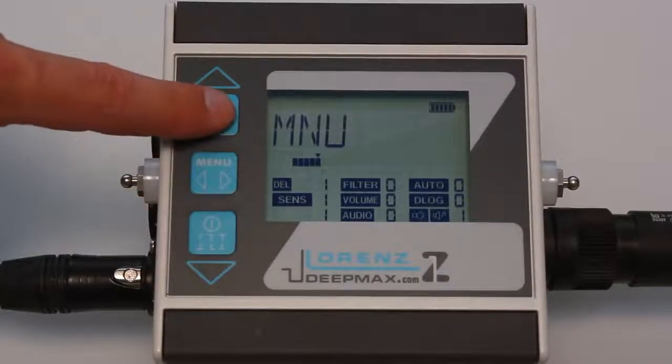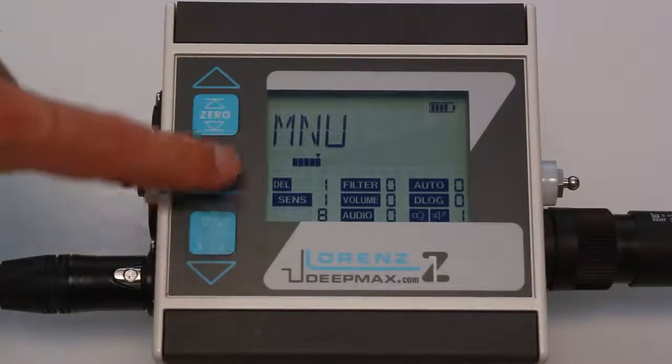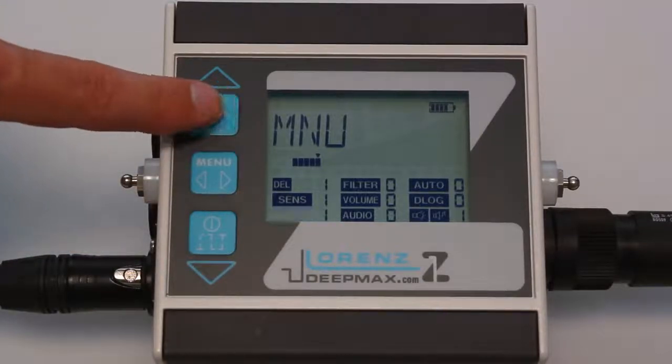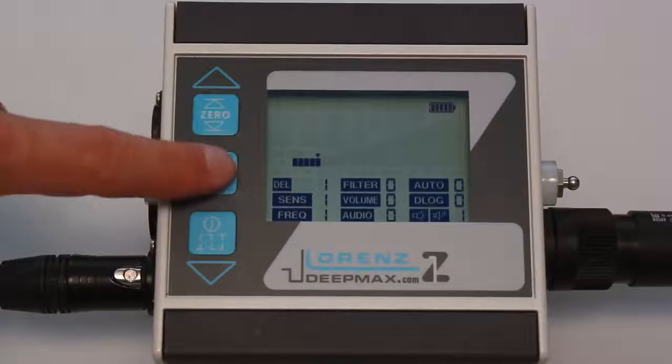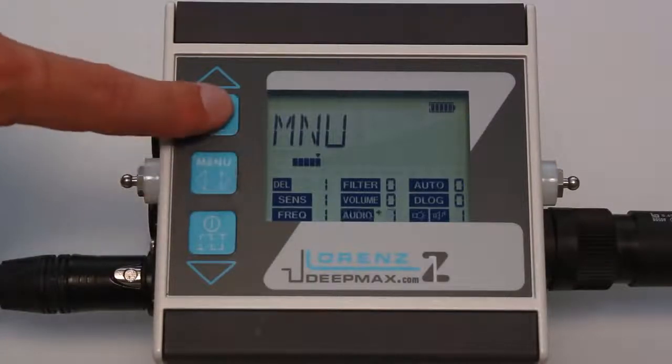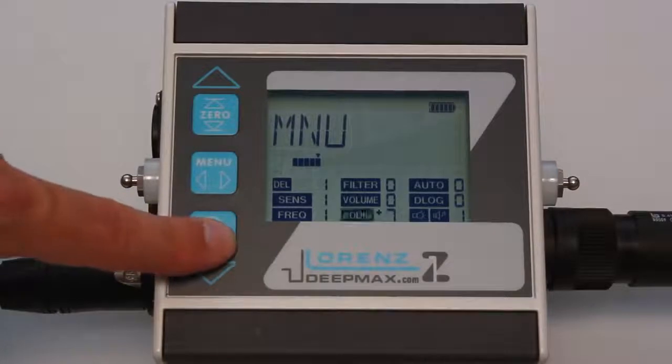Simply alter the working frequency when interferences from power lines or radio transmitters are present. Choose a position with low noise, little bar graph indications and weak audio response. The initial audio threshold can be altered from -9, silent, to +9, a low continuous threshold with the audio function. For most applications, a setting near 0 with a very faint response is perfect.